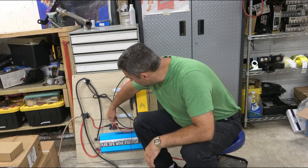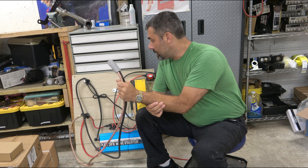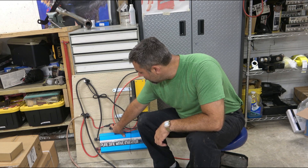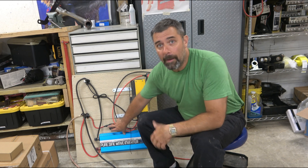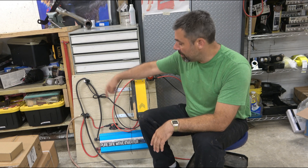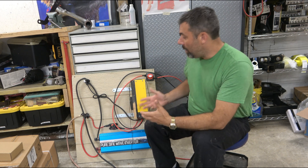Wiring goes over here, comes into the system, goes back out, and then off to the inverter. These big fat cables go to the lithium-ion battery — the big battery — which charges and holds power. Any excess power during the daytime goes right to the inverter, which has a 50-amp fusible link. I've had it trip about three times. When it trips, I'm no longer producing energy into the battery, but the battery can still power the inverter, so the way I find out it tripped is when the battery goes dead.